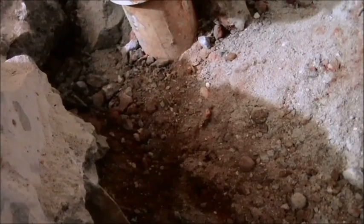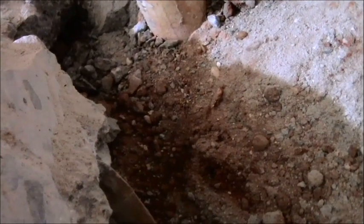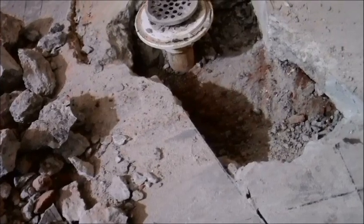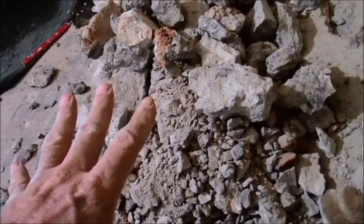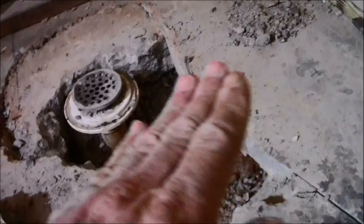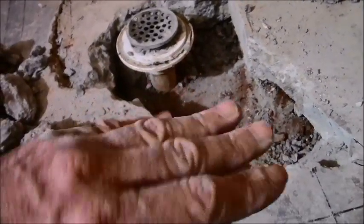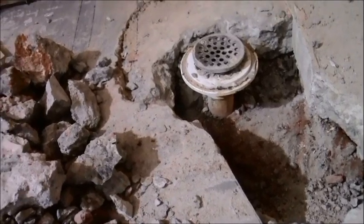This is at a point where I've got to dig into the dirt, because I can't put my 90 that close, because I'm going to have two 90s eventually. This is just dirt digging at this point. So my rock is going to get thrown away, concrete, and I'm going to start digging into the dirt and pull all that dirt off to the side, because you're going to backfill and pack down that dirt before you put some more concrete in. But that's basically the process.